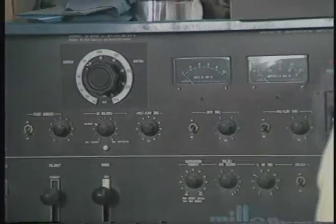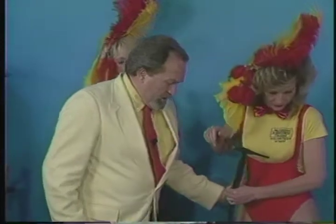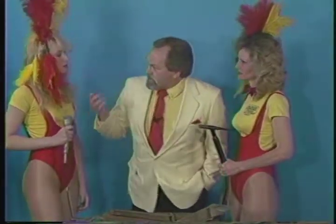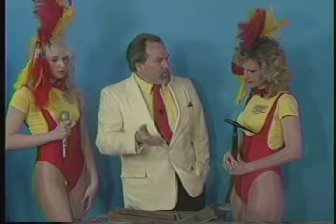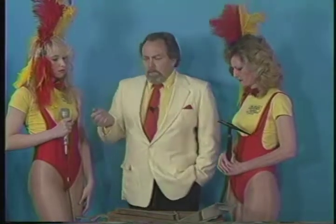Bill, does it make a difference? Like you said it on 140 amperes. Does it make a difference what you have that on, being that you regulate it with the foot pedal? Yes, it does, sort of. Because the range that you have with the control, I mean, this isn't exactly a Swiss watch, although it is a real fine adjustment. But if I've got it turned up to 375 amps, and all I'm looking for is 50 amps, boy, is that hard to control just at the beginning of the pedal. Right. So what you want to do is set it for about, now I know that for something like this I'm probably going to use 110, 100 amps, so I'll give it a little extra in case I want to get it started quickly and then back out of it a little bit, okay? Anyhow, that was a good question.